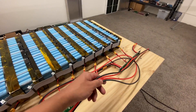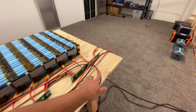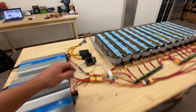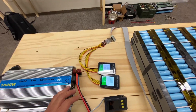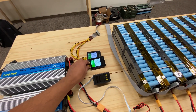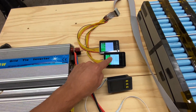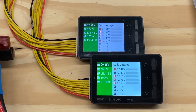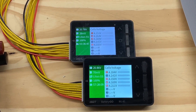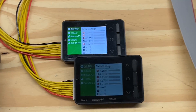Can the six of these cables carry 100 amps, or do I need four, or do I need eight? This battery is fully charged, but it is a little bit out of balance. Group number five is a little bit high — 4.2 volts — while all the other ones are 4.15, so there's a 69 millivolt difference there.